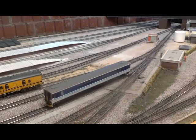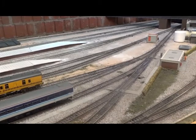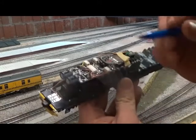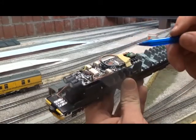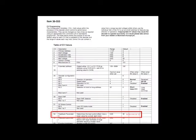As you can see, that's now jumping about as soon as I start the locomotive. All we need to do — you'll see the two capacitors and the 36553 decoder. The feedback parameter is CV54; by default its value is 32, and what we want to do is lower that value, which is ideal for small lighter motors.